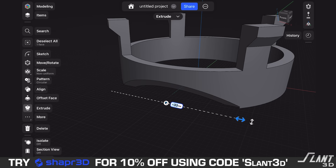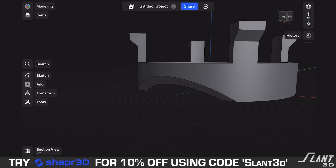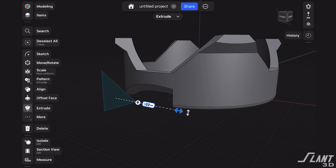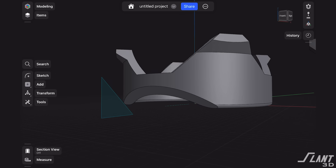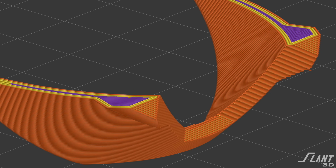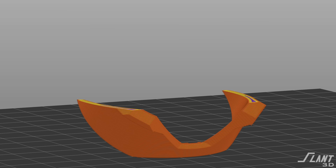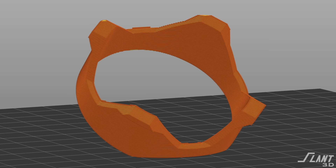This also requires a small cut on the bottom so that you actually have a flat surface to put against the bed. If you don't have a flat surface the part is going to fail all the time and you're going to radically increase your scraps. You can also extend this to the traditional piece itself — taking the same chamfered piece makes it even better because now you don't have to worry about the overhangs of the clips themselves, and you're able to balance it right up on its edge just as it's sitting there.